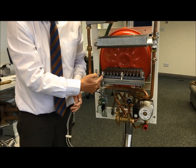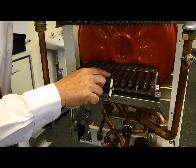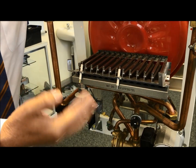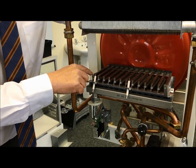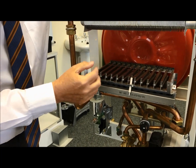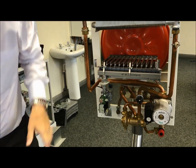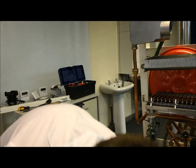Looking at these electrodes, the MI tells you that you need a 3mm gap between the burner and the tip of the electrode. If the electrode is too close to the burner, you can get a misfiring situation. So if a customer complains about aggressive ignition, always check the gap is correct — same with the rectification probe. My golden rule: imagine two pound coins stuck together — that's your distance. Small spade end is your spark, large spade end is your rectification.